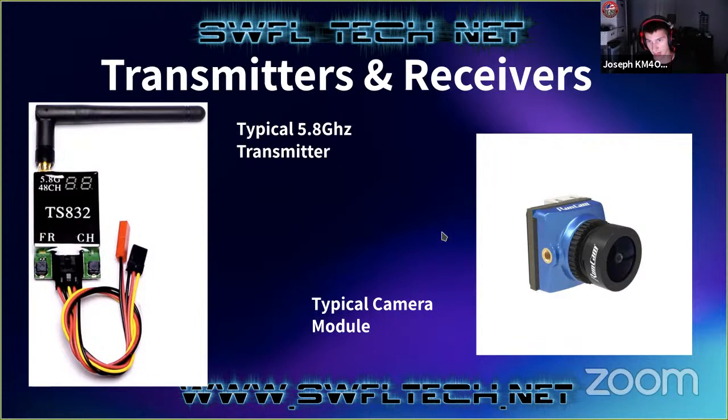These also generate heat. So if you're making a model, don't use hot glue on these, because the heat that they generate will melt the hot glue and it'll come off. I tried hot gluing my first camera and transmitter, and yeah, I learned not to do that pretty quick, because the hot glue got all pliable every single time you turned it on. So that's not good to do.